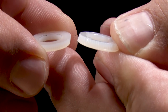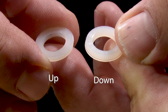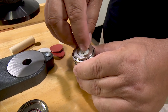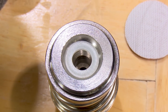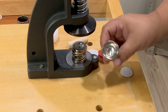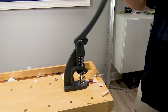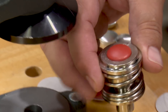Here's a close-up of the plastic ring that must be inserted in the spring-loaded die. When loading one of these into the die there is an upside and a downside — it's important to get the upside facing up into the die. Now we can place that die in the base of the W1 hand press. Then the die that contains the fabric and the button is placed on top of that. Simply depress the lever of the tool once or twice and your DuraSnap upholstery button is complete.